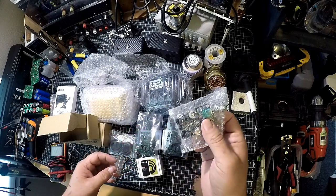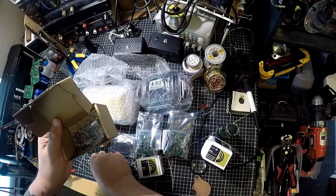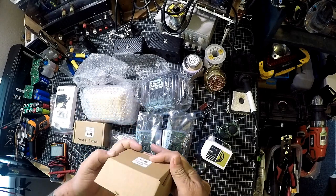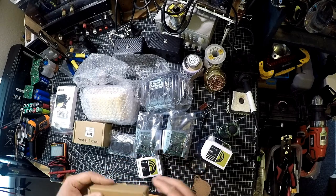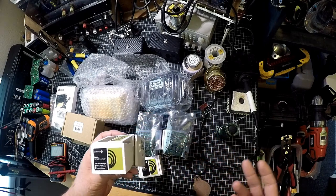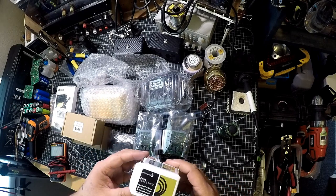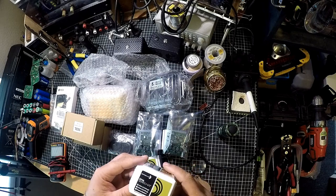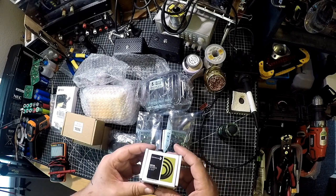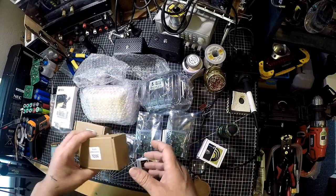The only issue is these are a little bit more powerful. These are 50 watts, but I believe it said at 12 volts, it's 20 watts. These DMA 45s are 10 watts RMS, which comes out to about 16 watts, and it's 20 watts max. Non-RMS, just 20 watts max. So I believe 20 and 16, I'm thinking these might do the job at 12 volts.